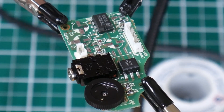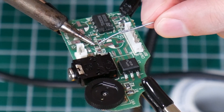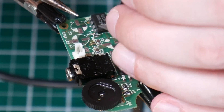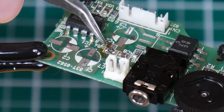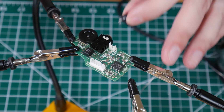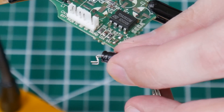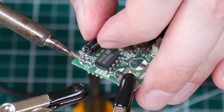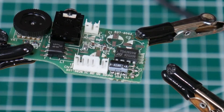I had a little trouble and knocked one of these tiny surface mount components off the board. I'm not going to worry about it — we're just going to solder it back on. I'm going to tin the pads here that we're working with. That actually gave me quite a bit of trouble — I struggled with that for about 10 minutes, but I did get it back on the board. Hopefully I didn't burn up that little resistor. So we're going to try and mount a through-hole capacitor onto a surface mount pad. I've bent the leads into a zigzag pattern and we're going to keep it bent low to the board. Just four more like that and we should be done with this board.